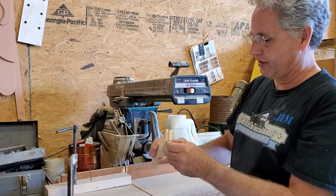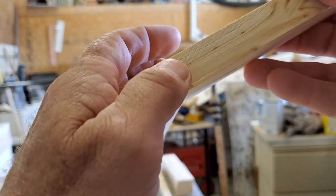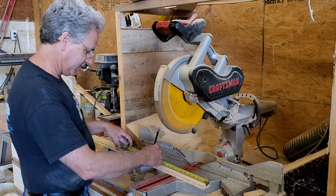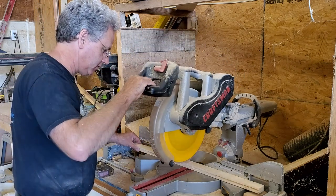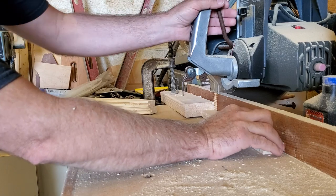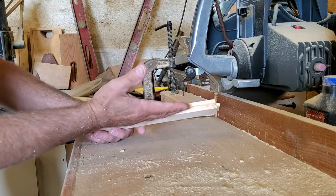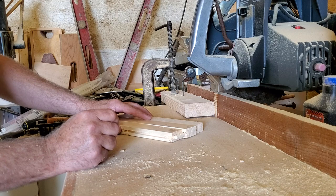There is our tenon, and you can see it fits directly inside our mortise. The bottom of our panel needs a series of three total pieces of the inch-and-a-half stock we did earlier, again at 13 and a half inches. We also have to put mortises in these lower pieces because the piece of plywood will need to be sandwiched on all four sides, so we'll need to go back to our center pieces and put a second mortise on them.